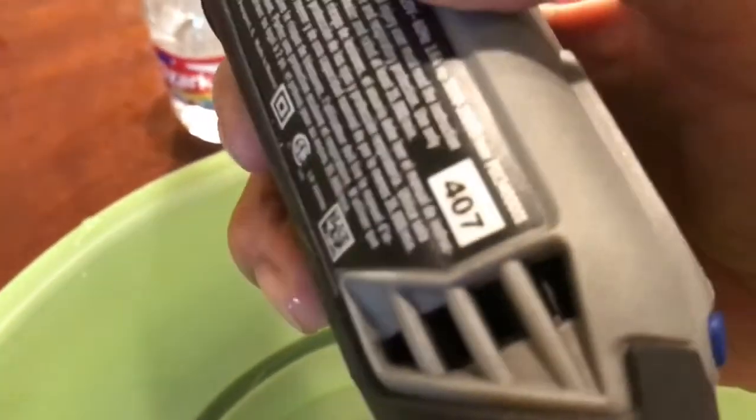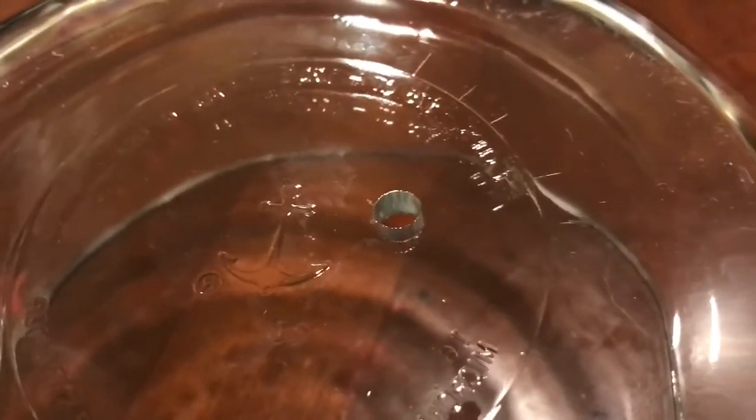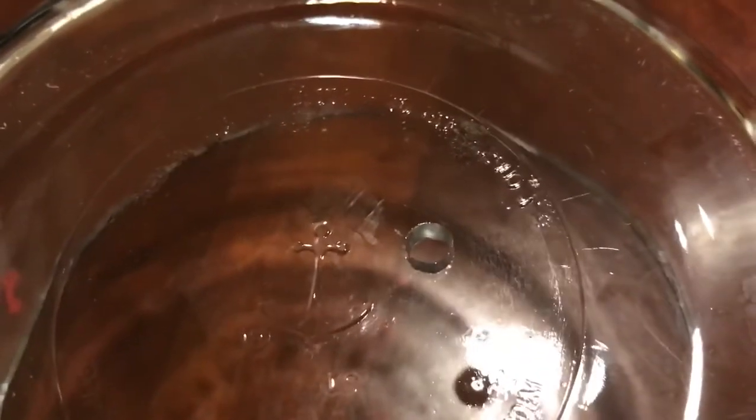The key is to use a diamond drill; you need a dremel. I've set this one on about 5000 rpm. Here's how it looks after I've dried it off — it looks pretty good for a first attempt. I want to emphasize that I'm using a pretty small, narrow-gauge drill, but I was able to drill a much wider hole by using the edges of the drill and just moving it in a circular motion.